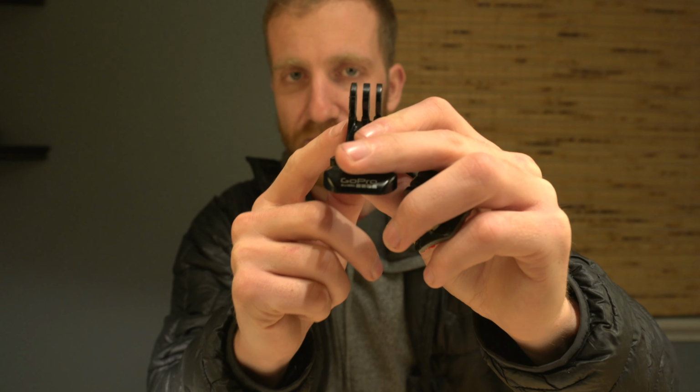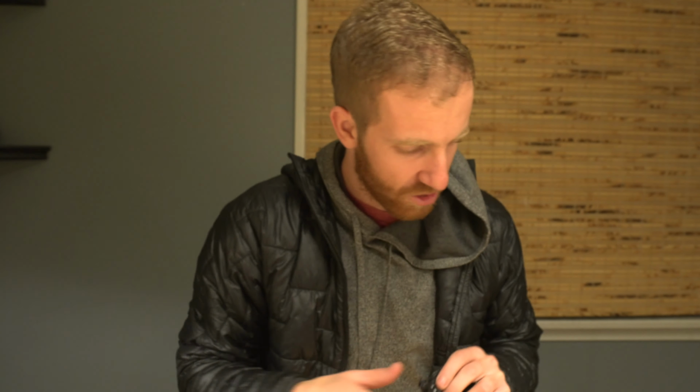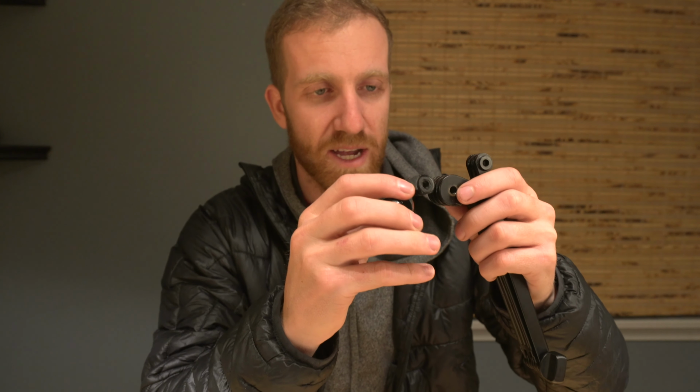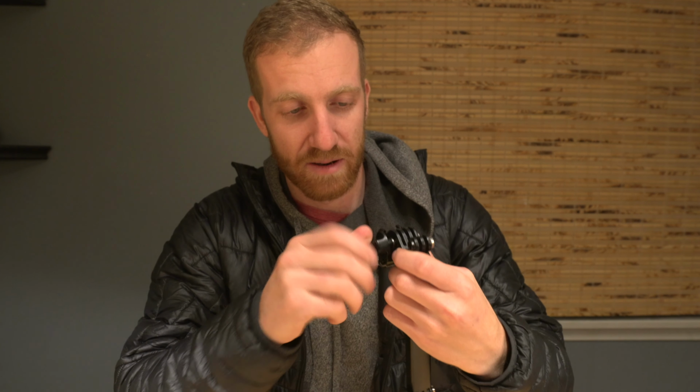And then this was pretty thick down on this side as well. So I just kind of filed all this and all this so that it would fit in between these three teeth like so. So with that, you can take the filed down J-mount and put it in. You want to be able to slide it so that this hole in the J-mount lines up with this guy. So I just kept filing until that kind of meshed up.